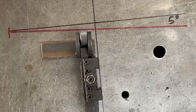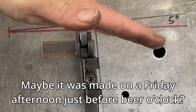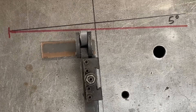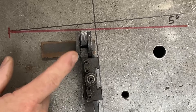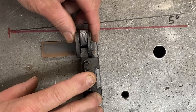Welcome back. I've got issues with my knurling tool. I've set it up on the bench so we can take a closer look. This top roller here, by default it's around about five degrees pointing that way. The lower roller looks to be quite straight, so you can imagine that this part of the wheel here will be digging in probably more than the bottom wheel — and this side of the wheel won't be digging in very much at all when you're doing knurling. This angle of the top wheel is how it is by default, and if I hold everything here you can see there's a lot of play in the head.